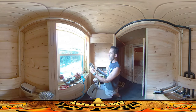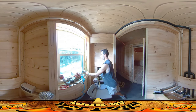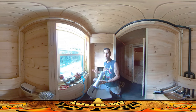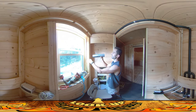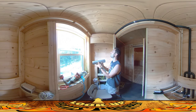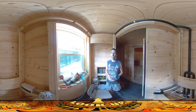As you can see, you can take something with two female ends and turn one of them into a male end so it can go in over there. I'm going to get this ready to go through up here, and then I'll be doing spray foam to seal them on their way through. Additionally, once they come through on the inside, I'm going to insulate the entire thing. From experience, I've seen that when it's cold outside, you can get condensation — cold air cools the conduit and you get drips on the inside of the house. So I'll either spray foam or put something around it to protect the house from condensation drips. That's what's going on right now — still just more work getting these in. Step by step, we're getting there a little bit at a time. That's it, thanks for watching.